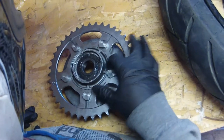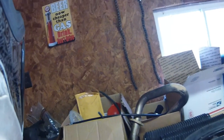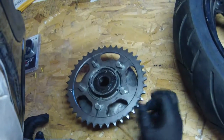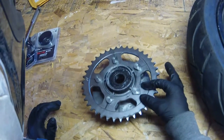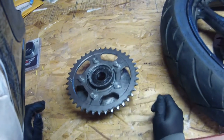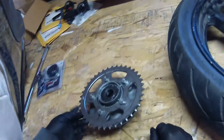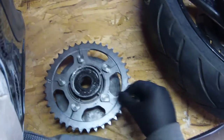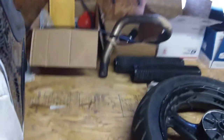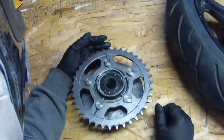These bolts have two flat sides — usually they just have one flat side. You're going to take whatever size ratchet wrench you like — I have these set for 15mm — slide it on there, and then take an angle grinder and grind down one side. Just grind it down slowly and test fit your 15mm or whatever size wrench you have until it fits, and then do that for all those bolts.